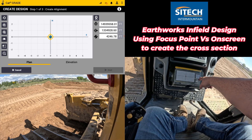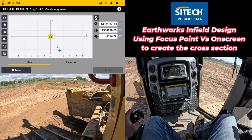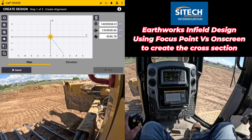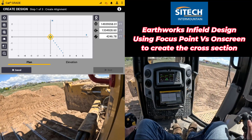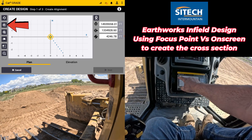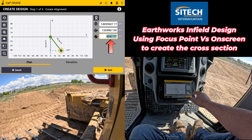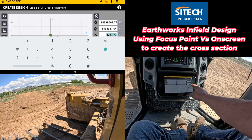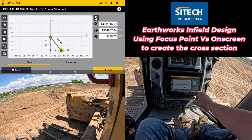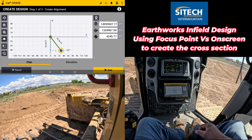So I have a northing, easting, and an elevation. Just like we've done on other alignments, now we're going to go up here and shoot another point where I actually want the second point for my alignment to be. We'll set right here and I'm going to go ahead and create a point. I know that I want that point to be a couple feet lower than the first one, so I'm going to take it from a 47 to a 45 right here — create that point just a little bit lower. Now that I've created my alignment, very basic, I've got a point-to-point which is the center of my v-ditch.